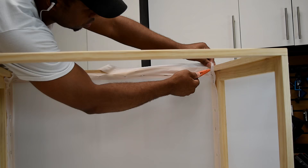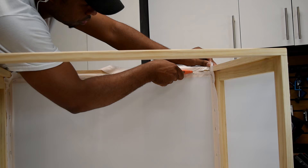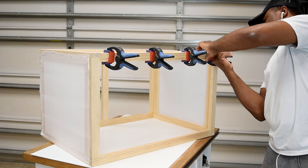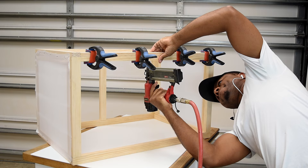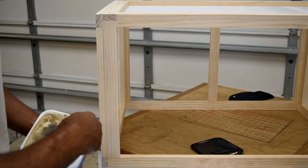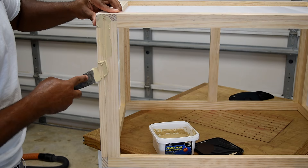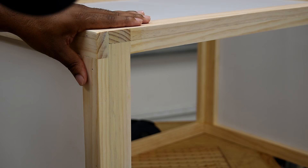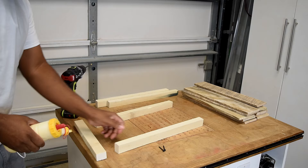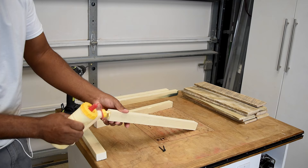It was actually a good thing I had an extra piece of lumber, because I needed it to attach the front trim. This wasn't part of the original plan, but attaching this trim allowed me to hide the loose ends of the fabric and the staples, making it more presentable. I held the trim in place with clamps to make sure there were no gaps, then secured it with brad nails. I did not add glue in case I need to replace the fabric in the future — I can simply remove the trim and swap it out. I used wood filler to fill in any remaining gaps and nail heads, and at this point the light box is pretty much done.